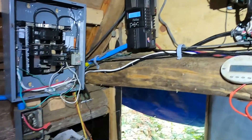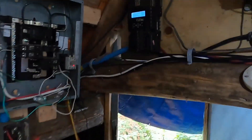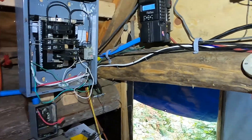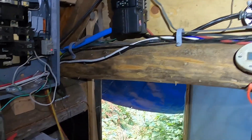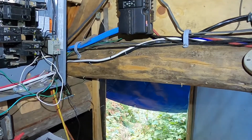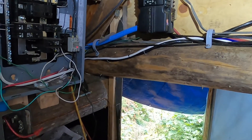We've just installed this system over the past six months. This is the A-frame with my 47 kilowatt-hour BYD-based battery system configured for 48 volts. I've got a Midnight Classic charge controller with about 3000 watts of panels hooked into that, and an Outback inverter.